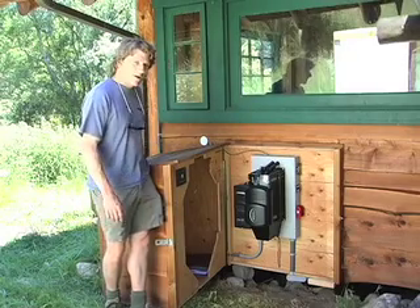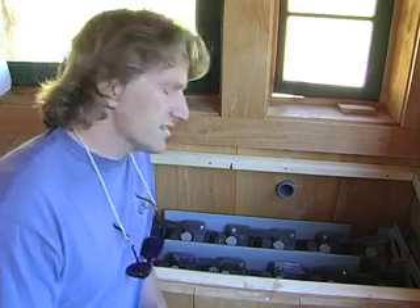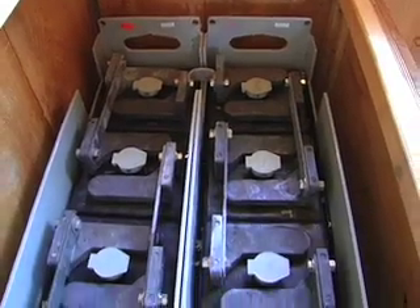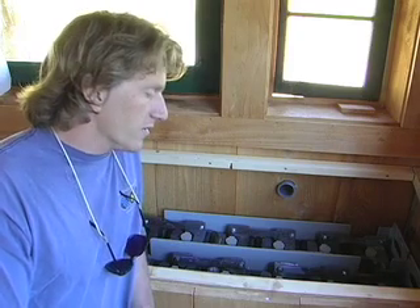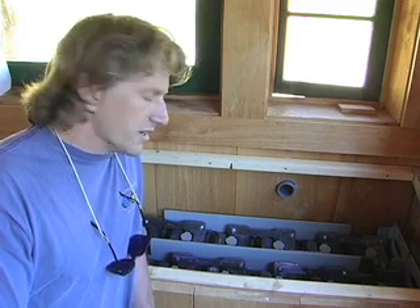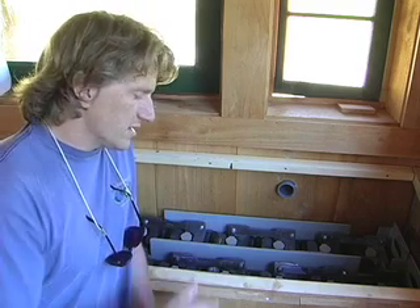Let's close up the power center and go inside to take a look at the battery. Here's the battery — this is a deep cycle industrial quality battery composed of 12 two-volt cells all wired in series for a 24-volt system voltage. These are very heavy duty deep cycle batteries designed for long life and deep discharges. They're flooded lead acid batteries, which means there is liquid electrolyte inside that will be turned into hydrogen gas when the batteries are charging — there is a chemical reaction that causes hydrogen gas to be produced.